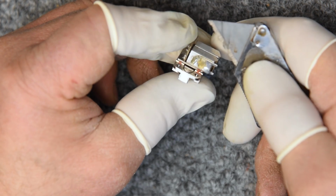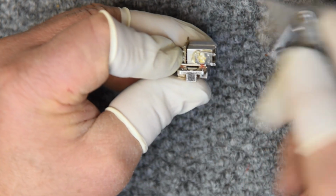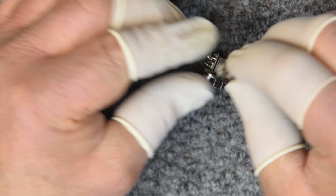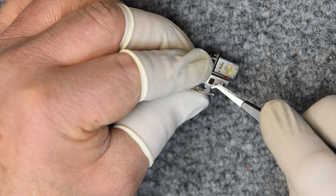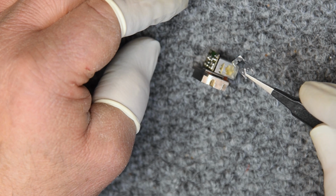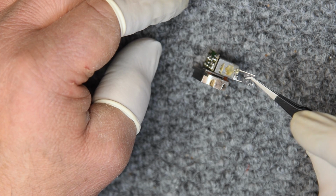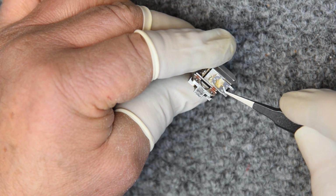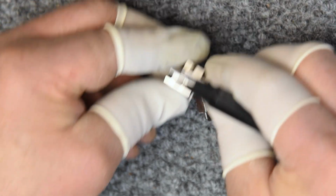So I don't expect this guide to be very well attached, and it's not. More than likely it was bonded with 5-minute epoxy. It kind of looks like that, kind of has that feel about it. 5-minute epoxy is really not usable for many things; I think the 5 minutes isn't the set time, that's the useful life of it. Anyway, you can't just bond metal to metal without any preparation like this. It needs to be prepared and the correct bonding agent used.